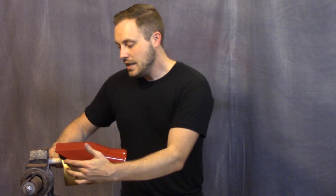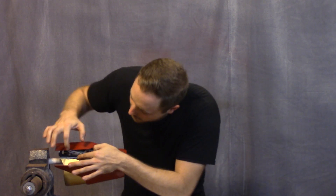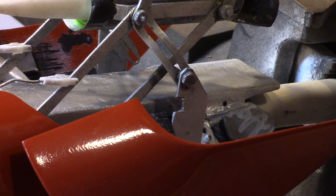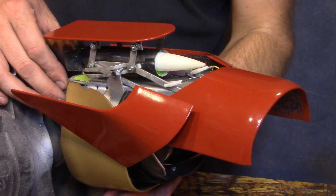Another problem was that the gold piece needed to be clearanced on the back because I forgot that the drop-down arms on the sides dropped down into the section where the gold plate is. It would hit and prevent the top from coming back, and then it wouldn't let the arms lift up so it didn't work at all. I had to clearance those and their mount locations to make that work.